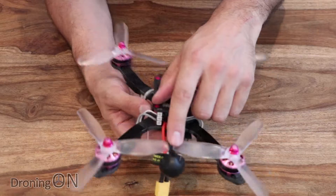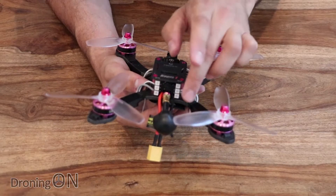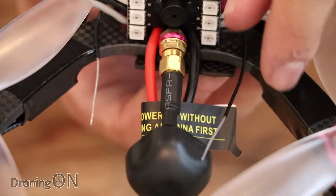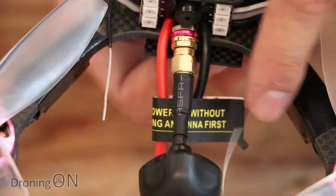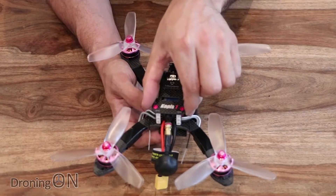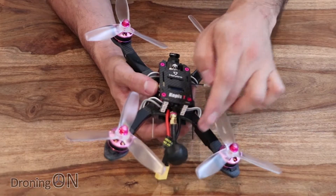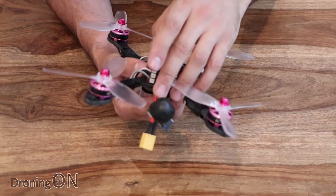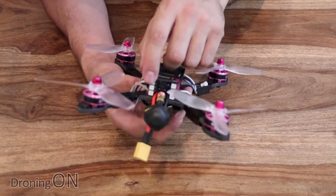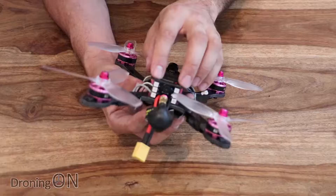On the side of the stack we've got a USB port for programming via computer — which we'll be doing next. On the rear we've got the main VTX antenna, a mushroom-style unusual-shape antenna. By the sides of that antenna we've got the 2.4GHz control antennas for the FrSky receiver. I don't personally like the way the antennas are routed — it feels a bit clumsy and they're potentially near the spinning props. I'd have preferred diagonal antenna mounts on the rear for maximum signal and clearance from the motors.